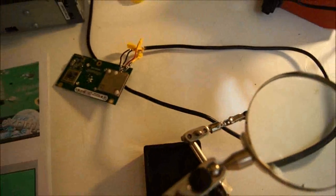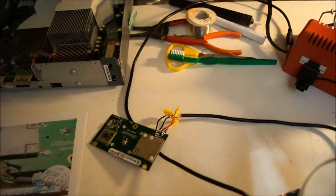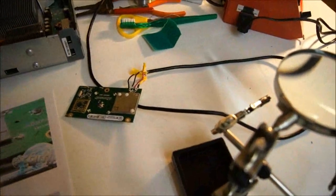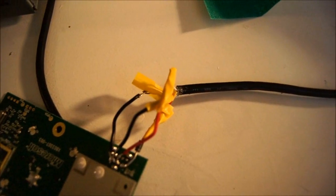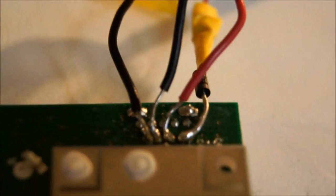Hopefully when you strip your USB cable it'll be color-coded, but if it's anything like mine, each individual strand will be doubled up with some kind of plastic thread. I just used a lighter to burn all that thread off, and then some sandpaper to clean out the remaining thread strands. And because they were too difficult to work with and still not very good at picking up solder, I decided to solder them to some solid core wire, which is much easier to work with. I cut the little ends of the solid core wire to pointed tips to make them even smaller.